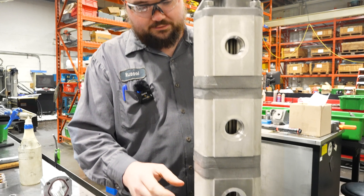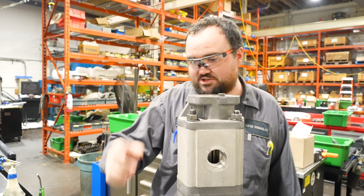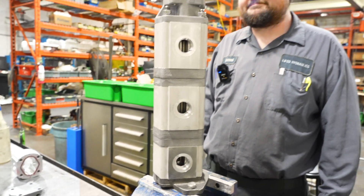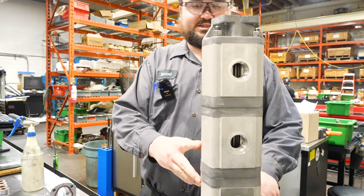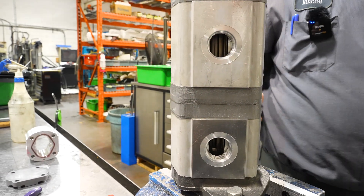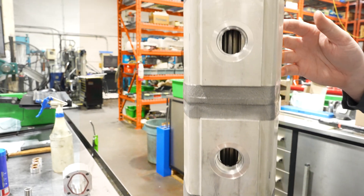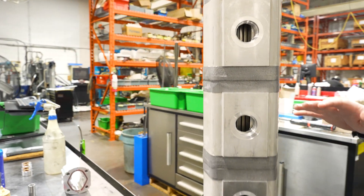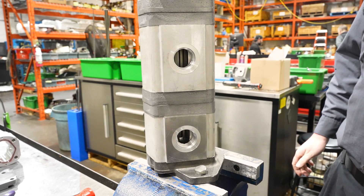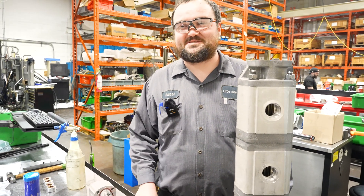We have three sections of PGP 517 and then the last section will be a PGP 511. Why is this so difficult to test? Each section is separate from each other - there are no common inlets. The stuff going into this one is not going to go into this one. Each section is individual - the oil will not flow between sections in this particular case. So they're all going to be hooked up with each individual oil supply line.